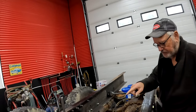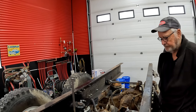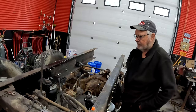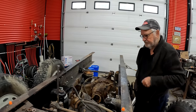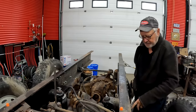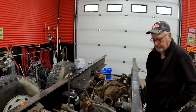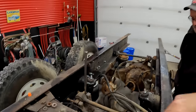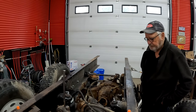All I've got in the front rear end to do is hook up the transverse torque rod, of which you can see it's not going quite according to plan. Well, I was a little confused because there's bolts in it. Well, if you notice, like I measured, and the axle is sitting just about, not quite in the right place, but the spacer's got to go between the transverse torque rod and the housing. Because of the frame, like, the insert. Well, because of the distance, eh? Like, because both sides got to be the same. Yeah. But I was wondering if it's faced out because we've got the insert there, which moves the transverse torque rod over. Yeah. Which would be why you'd need a spacer there. Yeah, it could be. Part of it. Washer.